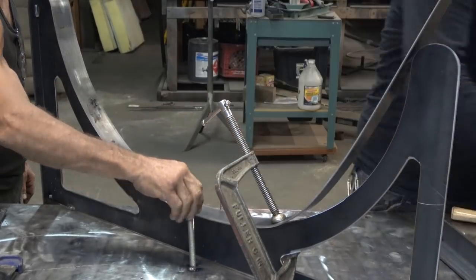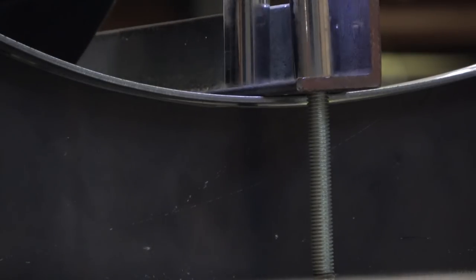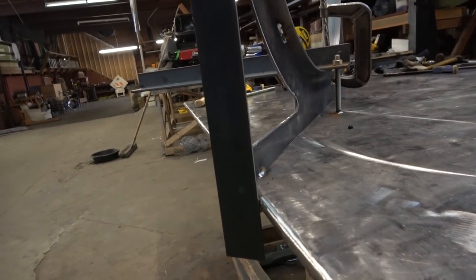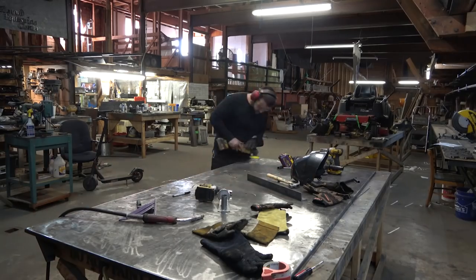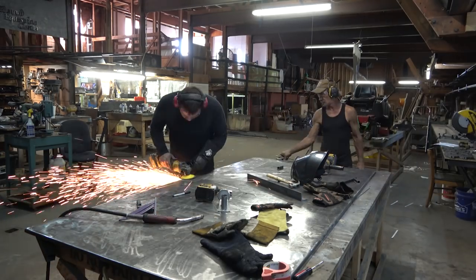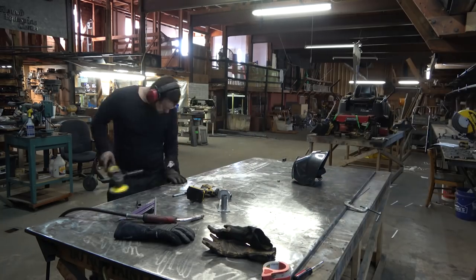So we're jumping over to something I've done in the past — just going to make a little spreader bar, then take some half-inch threaded rod, just some scraps we have. We always keep those. And we'll tack those right to the table, run some nuts down them, and then this little spreader bar becomes a clamp. It worked beautifully — the clamping force on those nuts is a lot and it just pulled everything into place exactly where I wanted it. The cleanup's pretty easy: just cut them off, grind the table flat again, and we're good to go.